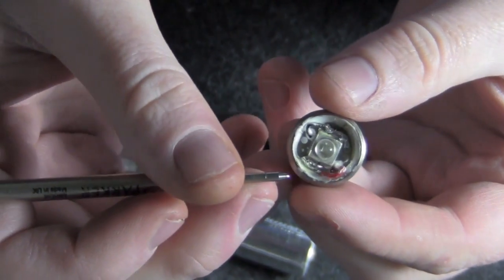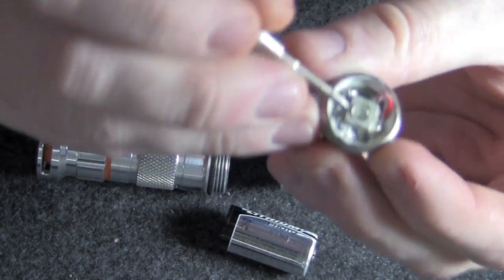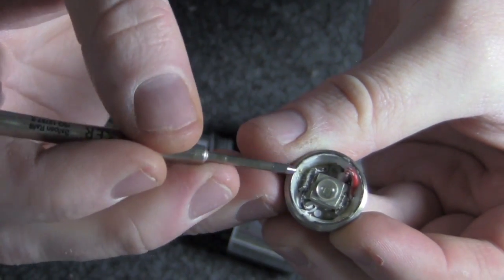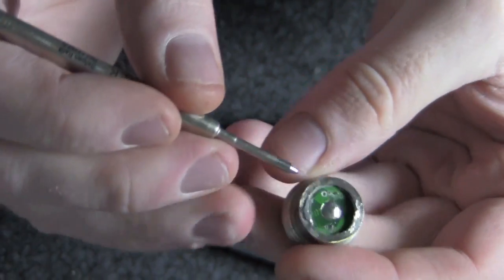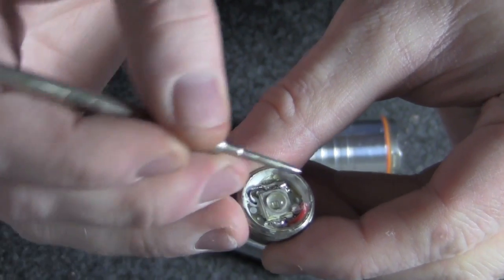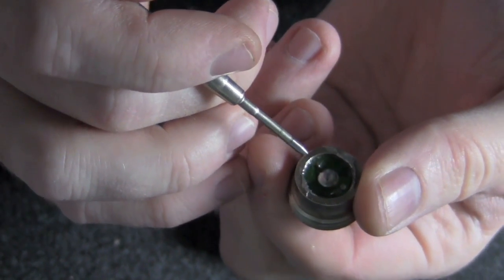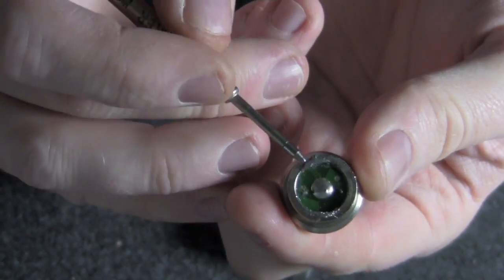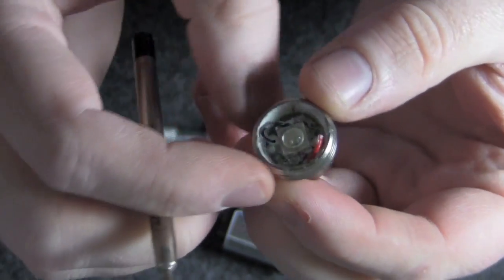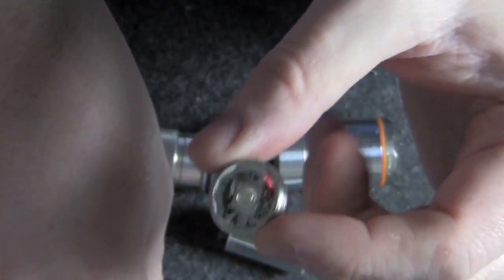That's not so much needed with this LED, but if you were using something a little higher power like an XPG or an XPE, you might want it. Next up we have my poor soldering job — these are silicone or Teflon coated wires and they run from the driver board through the potting compound and are soldered onto either side of the LED. The driver I used was a Bad Boy Next Gen 500, and it seems to drive the LED more than adequately, so that was a good buy.